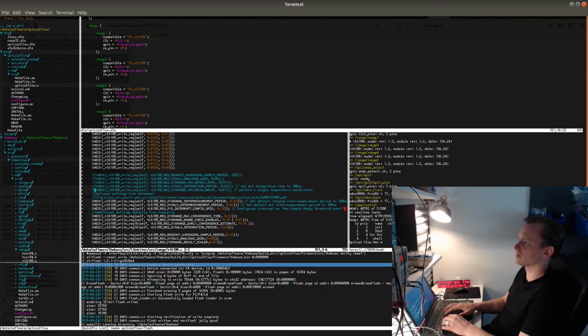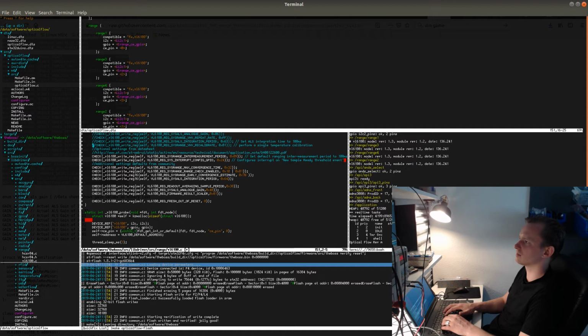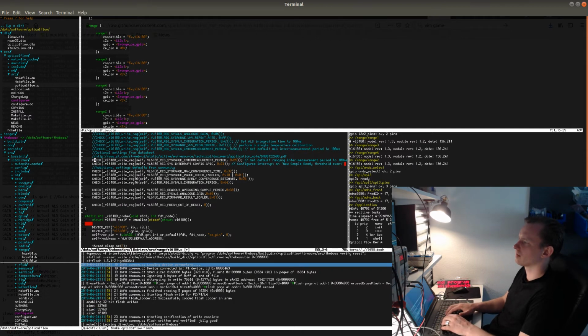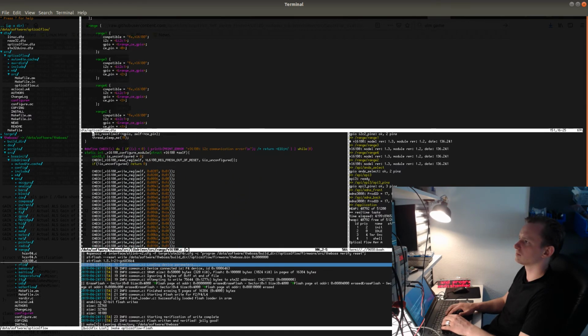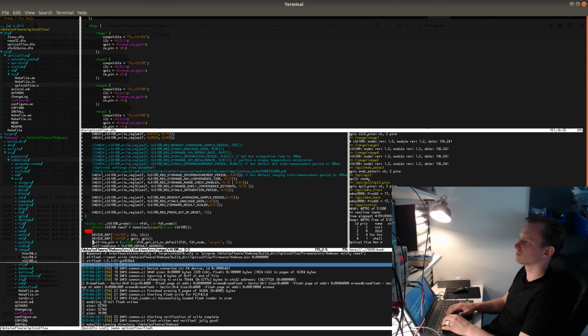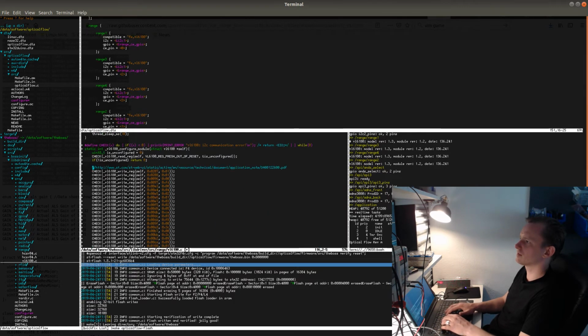And this actually performs the recalibration. So this is something that needs to be done explicitly, perhaps on command from the CAN bus. Let's see, intermeasurement period. This is also for the ALS system. Interrupt new sample ready. This is not necessary because I don't have that connected. And this link will go up here to provide a reference for this magic number block.